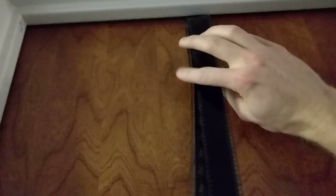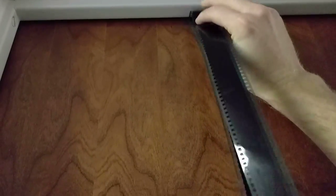This is taking longer using one hand than it would with two hands because I'm recording at the same time. Once you've got it going in, push it until you reach that mark that was made — that's right here on this one. That mark distance is essentially from the top of the door to a little bit below the handle, so you can measure it out. They're usually all the same size for ADA. Once you get to that mark, take the top piece and push it just a few inches further than the bottom piece.